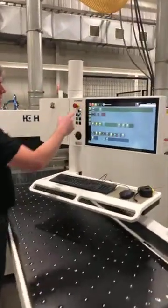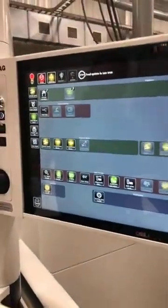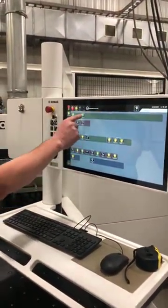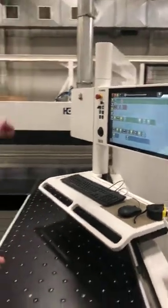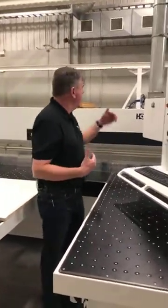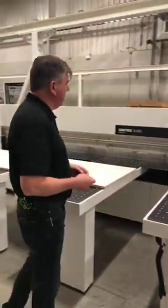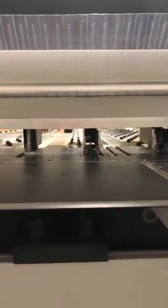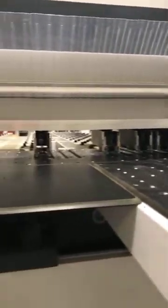Right now I have an error. The nice thing about the power touch control is it tells me I've got a problem — it tells me the feed is in the saw in the system. So I'm going to take it out of line mode and go into manual operation. What the saw is doing right now is referencing itself. The program is finished and we're going back to a reference switch and coming forward.